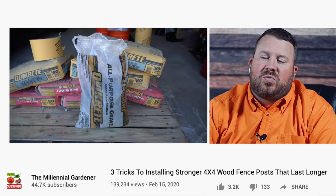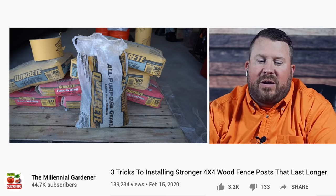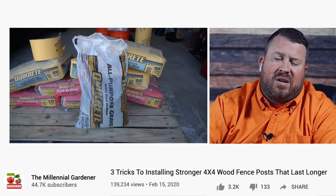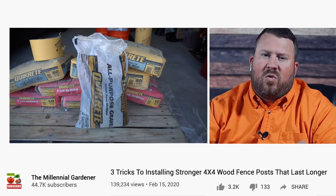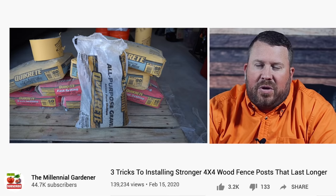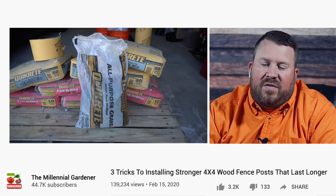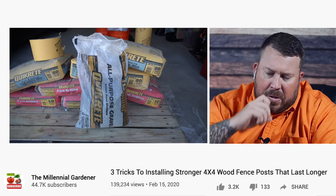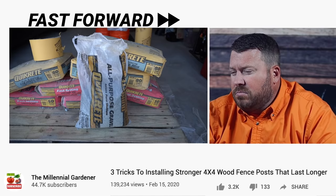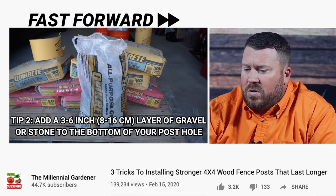I don't know that I've ever seen a post rot at the very bottom, if it was set two feet deep in the way this gentleman is talking about — where the bottom of the post is still extruding past the concrete. I would certainly encapsulate it. So when your post is set, you'll pull it up a couple inches, let concrete form underneath of it — encapsulate the post. I wouldn't go to the trouble of putting gravel below it if the idea is to prevent rot. The rot you're typically going to see in the first several inches of ground depth. I've never seen a post pulled up with rot at the bottom, but if you have, leave me a comment below.